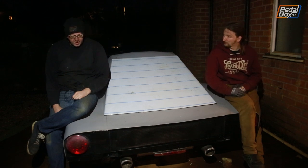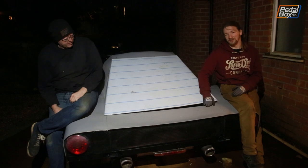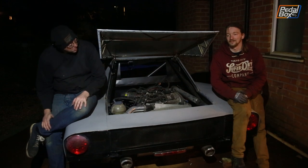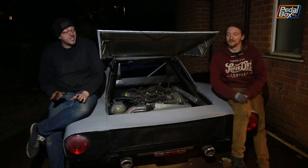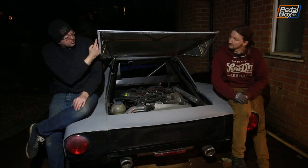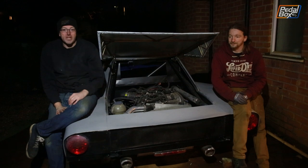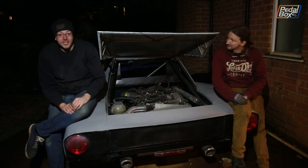We're a little bit cold — Aid's more than a little bit damp, and I've been sat on a wet bench and can't feel my toes or fingers — but honestly it's definitely been worth it because we've just made this and it's awesome. I'm really pleased with how it's come out. I was concerned about rounding these edges over on the aluminium and didn't know how that was going to go. What we did in the end was just rolled it over the edge, then rolled the side and pop riveted down the two sides. The front and back hold perfectly as is. There are a couple of spots where clamps made some little dents so a little bit of body filler will be required, but functionally this is the bomb.